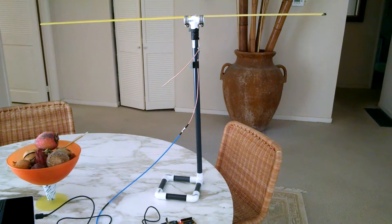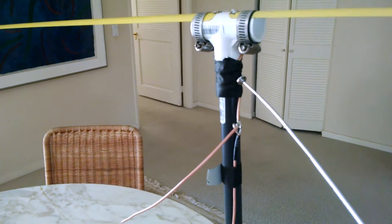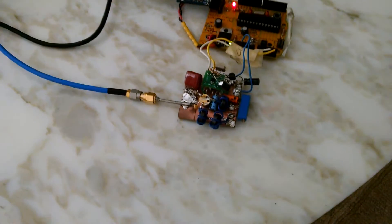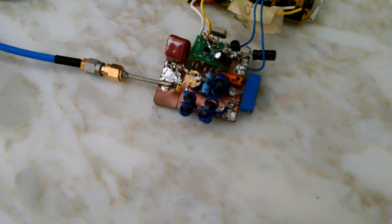This is my transmitter that is transmitting CW on the VHF band. The antenna is tuned by series transmission line and shunt open-circuited coax cable. The transmitter consists of just a power amplifier and a signal source, which is a PLL. In this video, the PA is not even turned on.